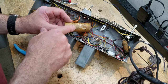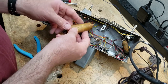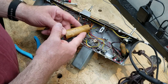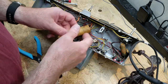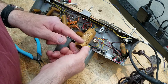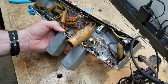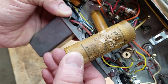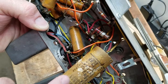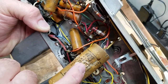So what we have are two 30 microfarad at 100 — you can't tell if that's 150 or 450 — a 20 microfarad at 150, and a 20 microfarad at 25. The clamp has caused deformation; this thing got hot and the wax melted and allowed it to squeeze. In any event, this thing is no good, and the tar is leaking out of it. So we've got four capacitors there. Looking closely at the label, it tells me the color of each value: 30 microfarad yellow, same for red, 20 microfarad at 150 volts for blue, and 20 microfarad at 25 volts for green.